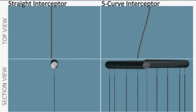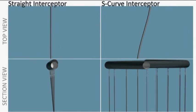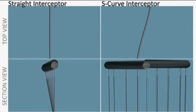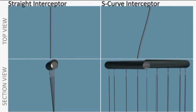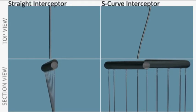On the left, you can see a scenario with a straight pipe — bird's-eye view at the top and cross-section view on the bottom. With no S-curve, the fixed tether pulls the pipe down from its proper grade several feet during temperature fluctuations. On the right, the pipe with the S-curve limits movement to a fraction of an inch during expansion and contraction, which allows the system to maintain its seven-foot slope eastward to the wastewater treatment plant.